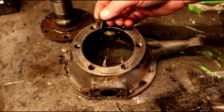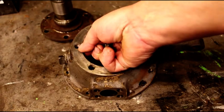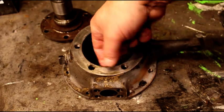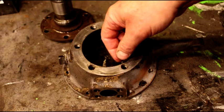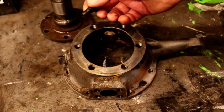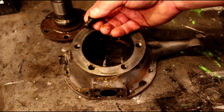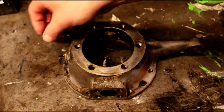Anything less than that is not good. Now this area right here, the thickness of this area, depending on where you measure it, is anywhere from 280 to 319 thousandths — well below the 9/16 of an inch that we would need for proper thread engagement there.